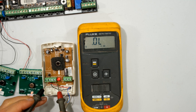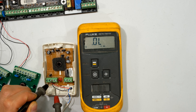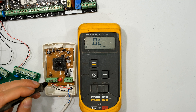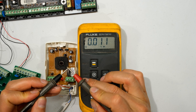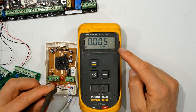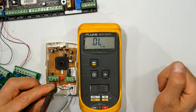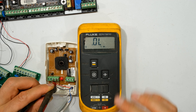Starting with a working unit - here I've got the positive, negative, and the NC (normally closed) contacts. It's supposed to be a closed circuit all the time, and when the LED indicates motion detection it becomes an open circuit. The meter is buzzing indicating continuity - a very low impedance path, less than 10 ohms. Notice when I move it becomes open circuit; when I stay still it becomes closed circuit again.